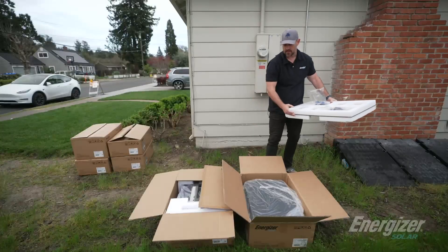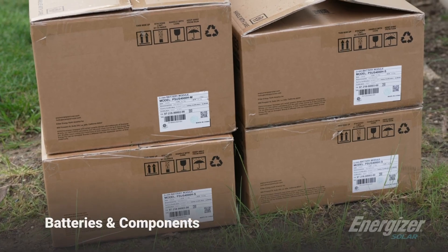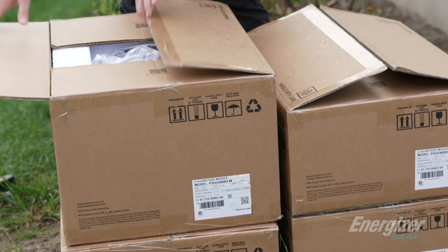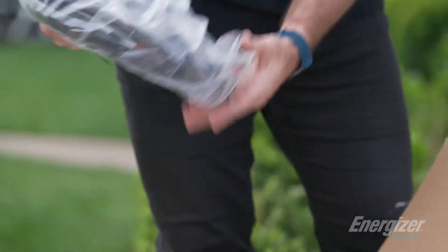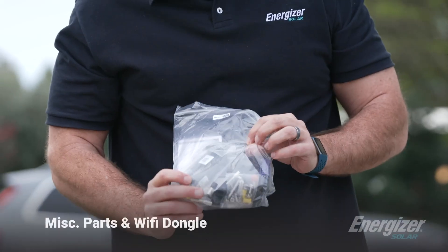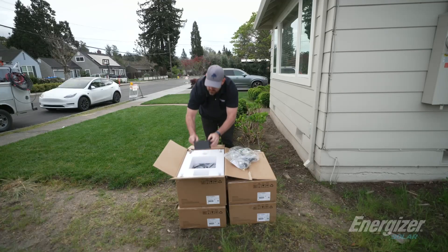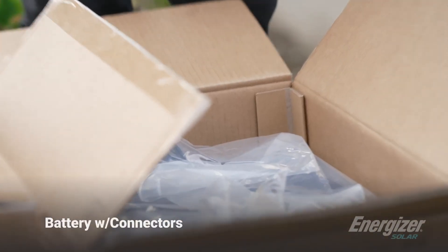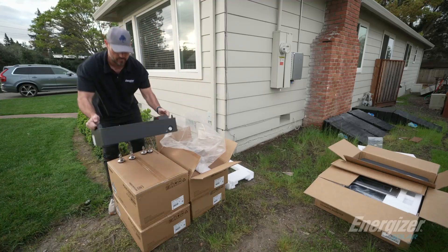As you open it up, inside is the gateway — comes wrapped and padded. So now we have our two battery components. This system that we're installing happens to be about 16 kilowatt hours, so there are four batteries, each one with about four kilowatt hours. First we have what we call our main battery. This comes with most of the components you need: four kilowatt hours plus a BMS, battery wires, comms cables between the battery and inverter, miscellaneous parts including the Wi-Fi dongle, and ground cabling. Also in this particular box are the feet for the base unit — you screw these in and then there is a cable cover that will secure your conduit too. In the regular battery box is what we call our subs: a simple battery with two connectors to secure the batteries to each other. There are handles on each of the batteries.